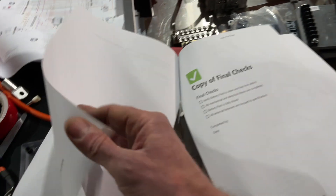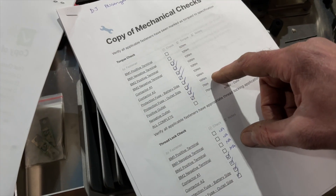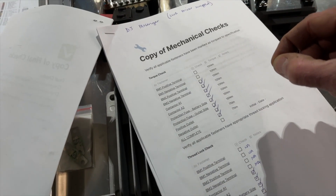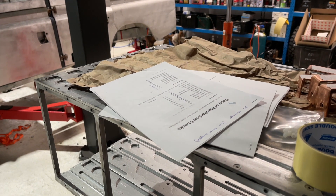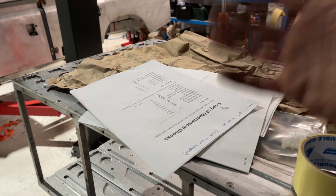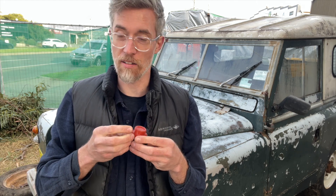It's been signed off. We have the torque ratings of every bolt that goes into the car, checked and signed off again after completion. All of this documentation is accessible to the owner through our system. An inertia switch is basically a relay controlled by motion rather than electrical current — if I shake this you can hear the little ball bouncing around inside. That's now open; I press it and close it again.